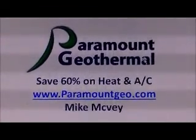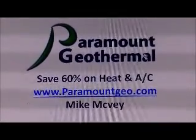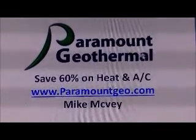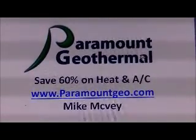The horizontal loop is bringing water into the heat pumps at anywhere from 85 to 90 degrees or even higher at the hottest times of the year. So the constant well temperature at 75 degrees, which will not vary throughout the year, results in a system that has very reliable, predictable, and excellent performance efficiency.